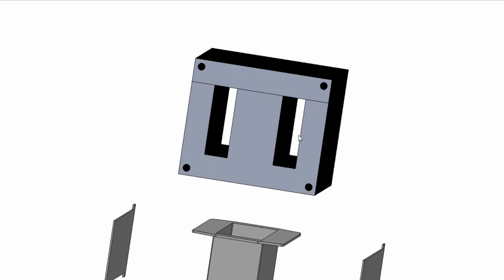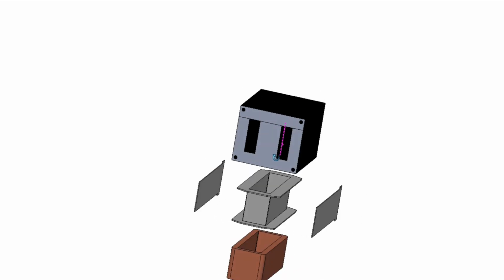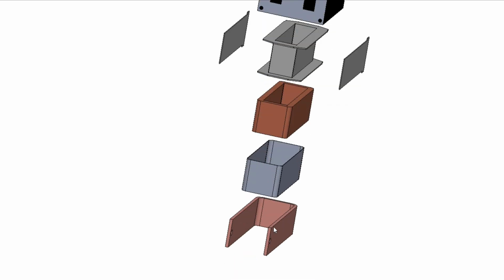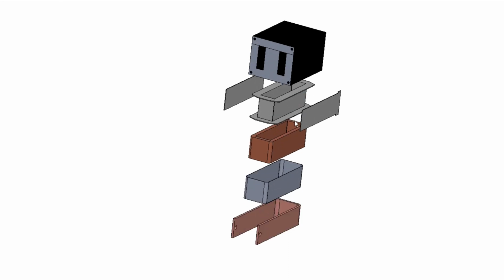Rather than people that strip microwave transformers and run a couple of turns using 16mm squared cable or something, this here I think needed to be 200mm squared or something for the calculations I've worked out, and I think I've got it up around there. Was it 200mm squared cable required for the high current? But because it's a spot welder, it didn't need it. It's only being pulsed, so I think I got it down to 100. I'm not actually sure. We need to look at it in the calculations in more detail.